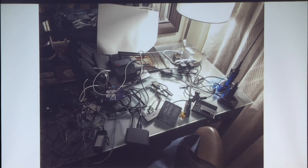This is like — does anyone else's hotel room table look like this? Then you're doing cons right, in my personal humble opinion. In the lower right-hand corner is the Baofeng that's doing the sniffing. The blue LED is showing there's activity on APRS coming in. Then there's a hot mess on the table because cable management. As of this morning, these are all the people I was picking up. You've got a list of Kismet lines — the ham radio call sign in the first column, it's coming from a REST APRS device, and as packets are received and decoded, the packet counter does its little tick tick tick.